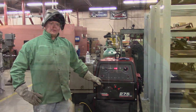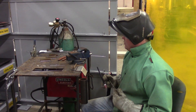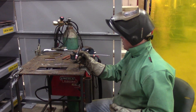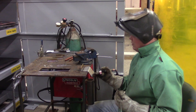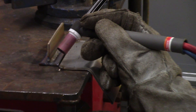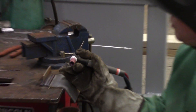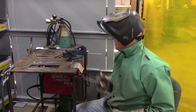Now we'll show you the setup of the table. We're doing our 2F fillet weld T-joint with TIG, and the table surface is all rough, so what I did is I added this plate right here so that my hand can slide right down the joint. If your table has burrs or something on it, you're going to want to put something smooth on there so that you can slide right down the joint nice and smoothly. We bent this piece of stainless down just to do this weld here.